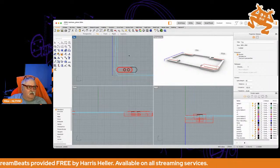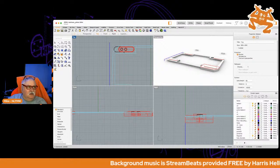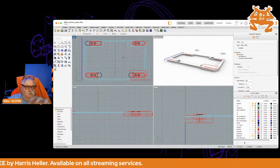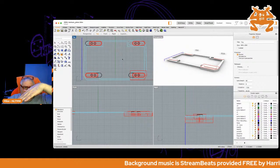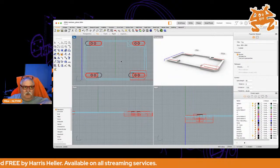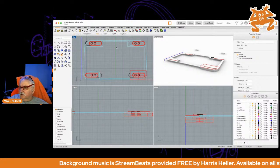The idea here is that the magnets will line up right in the same spot, the two of them. And part of the future plan might be to make this oval big enough so that I can flip it either way on the base. So if I make the base at a certain angle, I've had one person ask me to have it back tilt because when he stands, when he does his show and the desk is low, the angle's wrong. So he wants it to tilt actually backwards more, just below flat backwards. That might be the way to do it: make one angle, and then if he wants it to back tilt, you can spin it. So that's why there's the extra ones there.